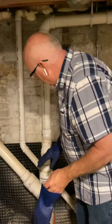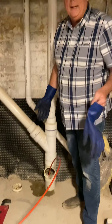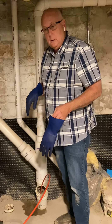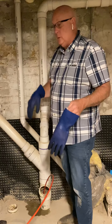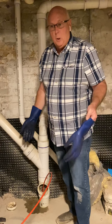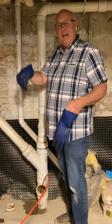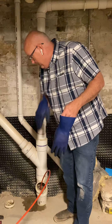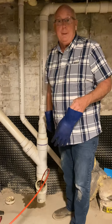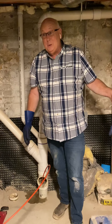What is a sewer scope and why would someone want to do it? So this is our main sewer line. From here we have below-grade sewers. We don't have an ejector pit or overhead sewers, so everything in this house flows down below — and that's how most of Chicagoland and the nearby collar communities work. The further out you get, most people will put overhead sewers in. But regardless, it follows a pipe that goes out to the street sewers, and that all belongs to the homeowner.